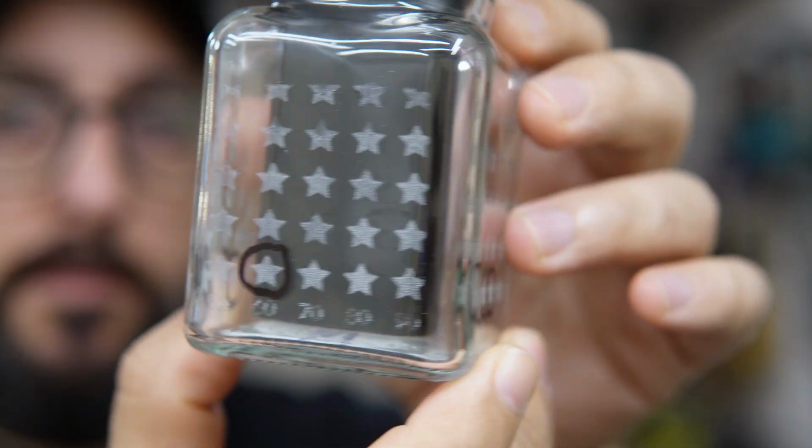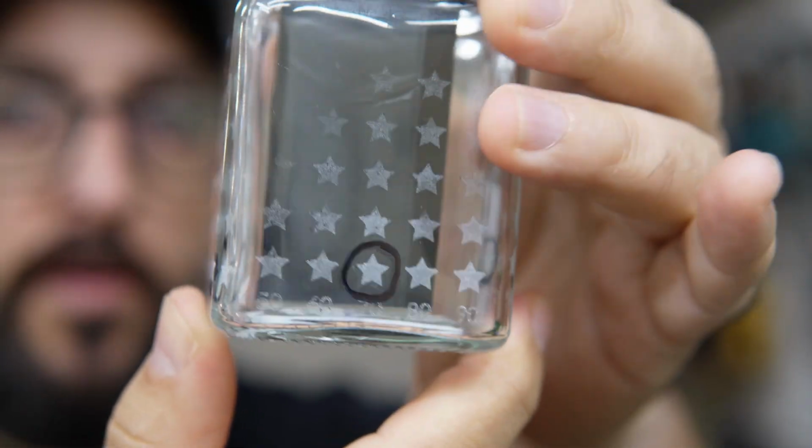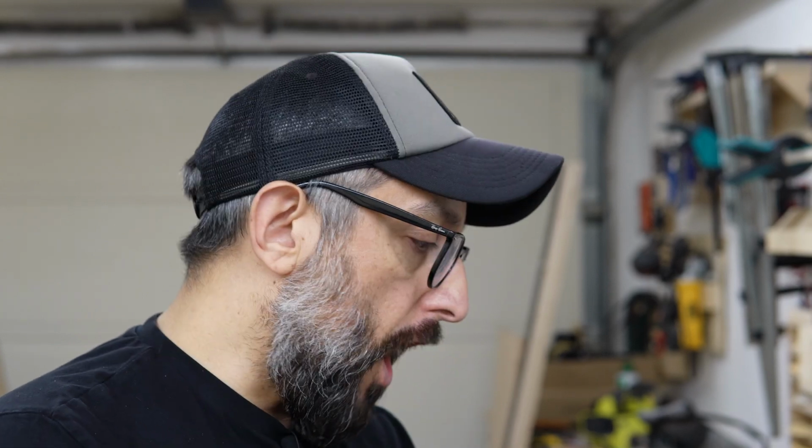Hey, listen, so now we're going to do the serious engraving. So we got our numbers. Me and the missus went over the ones that we thought worked best. As you can see, most of them are in the 100 speed and either 70 or 80 power. So now we will put them to the test, the tempera, the chalk, the acrylic, and the marker, and we will see with this Western vintage type of whiskey label which one does best. We'll see. I'm not going to get too excited just now. All right, stay tuned.